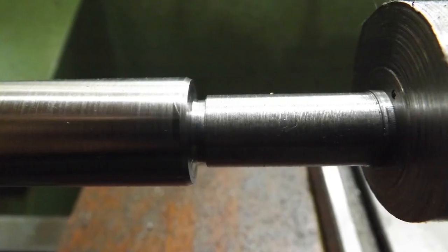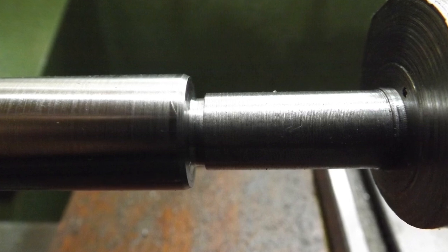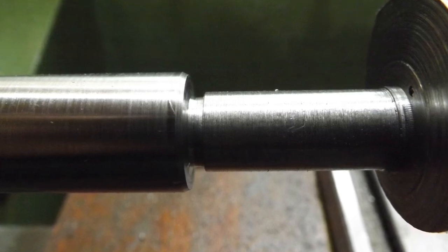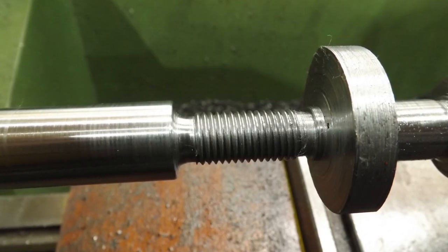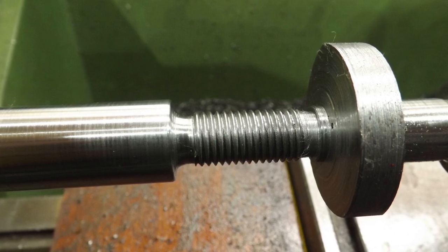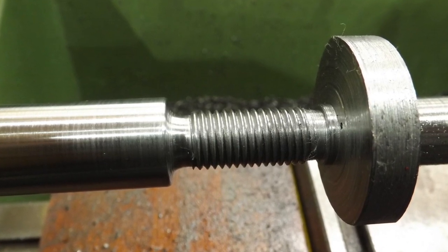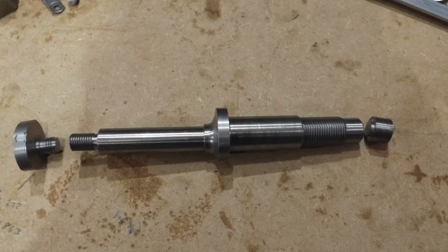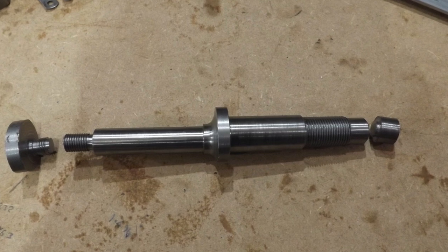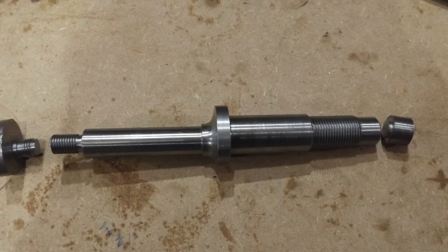The Mark II gave me a better chance of getting the smaller end thread completed a little easier. The half inch BSF by 16 TPI was going to be done by using a die holder for this task, but I elected to swap the change gears and give the hand crank another outing. And after threading, I partly trepanned the last bit off and then used the hacksaw to finish off before grinding the end. This bit's done.